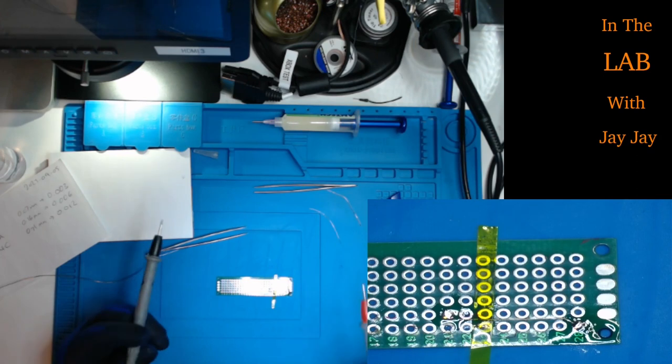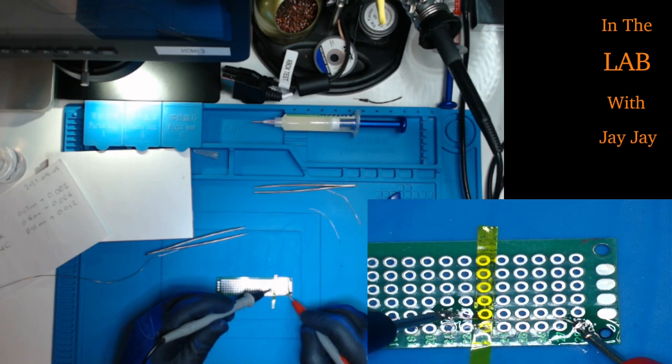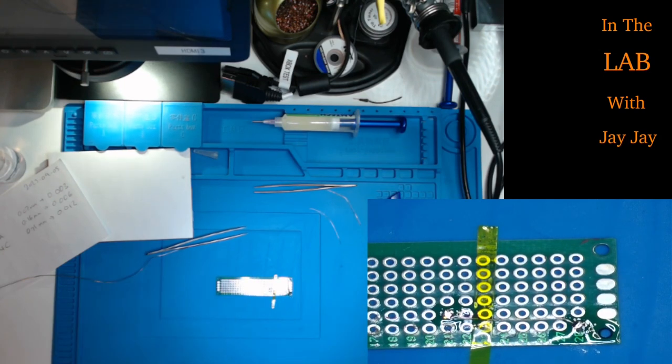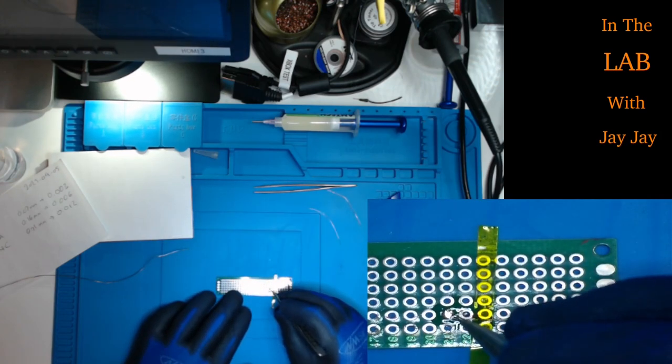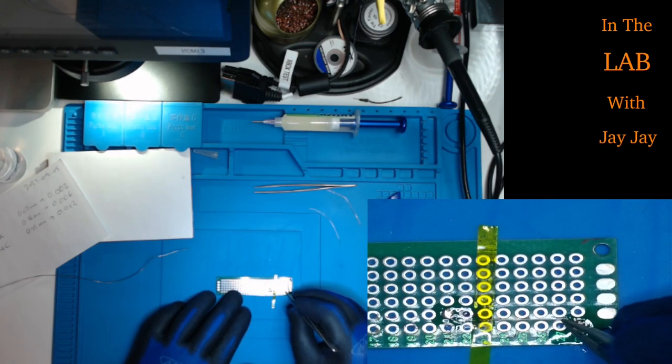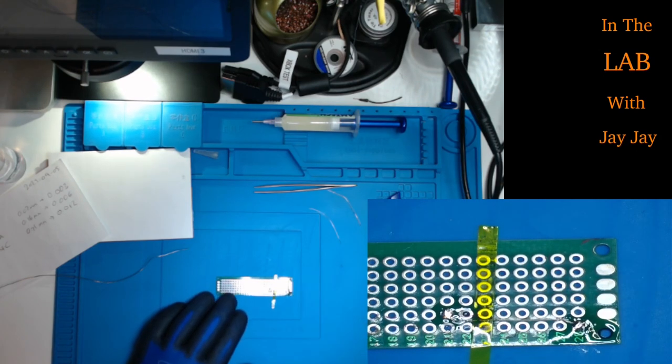You can hear that beep, beep, beep, that's good. And we'll just make sure we've got continuity from here to here. And of course we do. So it's ready to proceed. Now there's no reason to take this tape off the board yet. We'll just leave that there for now. We'll take it off later. And we can fine tune the wire, just pushing into place a bit. There we go. Can you see that? Yes, you can. Anyway, that looks fairly good to me. Of course, we need to clean up the board, but we'll do all that at the end.